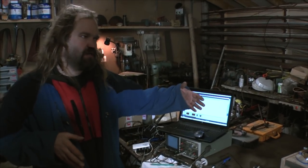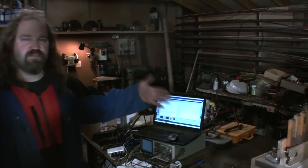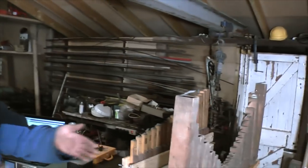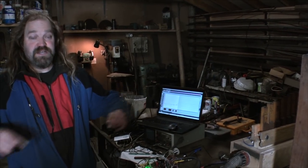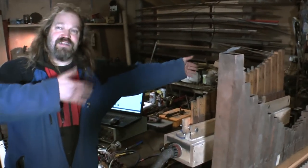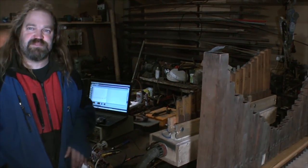I believe up in your room, in the upstairs, we've got a 24, the two octave rank, which pretty much takes on from where these end. We've got an extra lower octave of bigger pipes, plus an overlap octave. So the next step is for me to get that compound note chest I've got working at home, wire it up with some little tubes to that pull-down chest that we restored very first thing off, and then stick a chest of bigger pipes behind it, and then we've got a decent range.